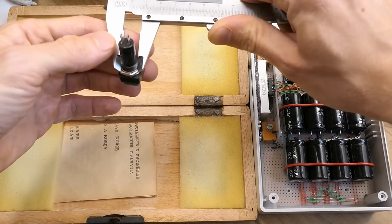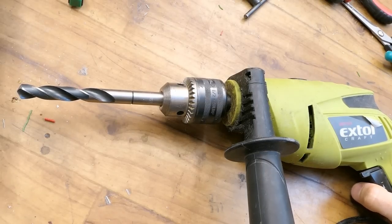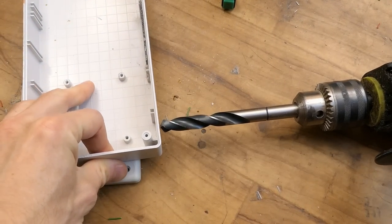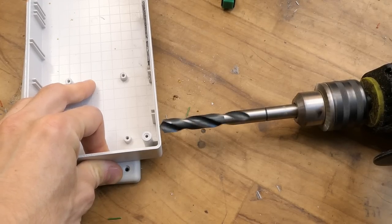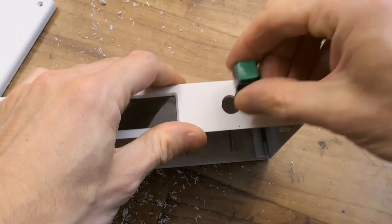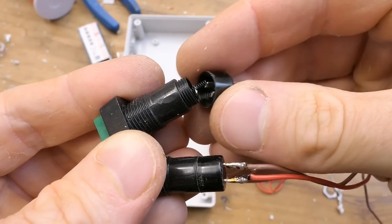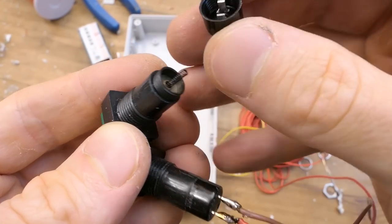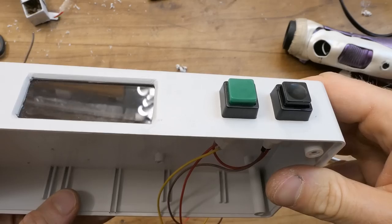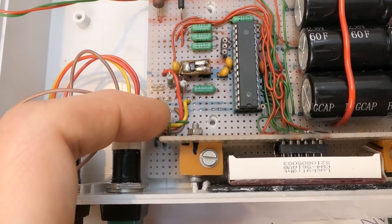The diameter of this button is 11.6–11.7 mm, so you need a 12 mm drill bit for this — and of course no lithium-ion batteries here. Every professional machinist is probably having a heart attack. I should probably pre-drill it with a smaller bit. Soldering the wires to the buttons — these buttons can even be disassembled and the contacts cleaned or transplanted from another button. The buttons are connected and also tied to the board using green wires so they don't fall off so easily.